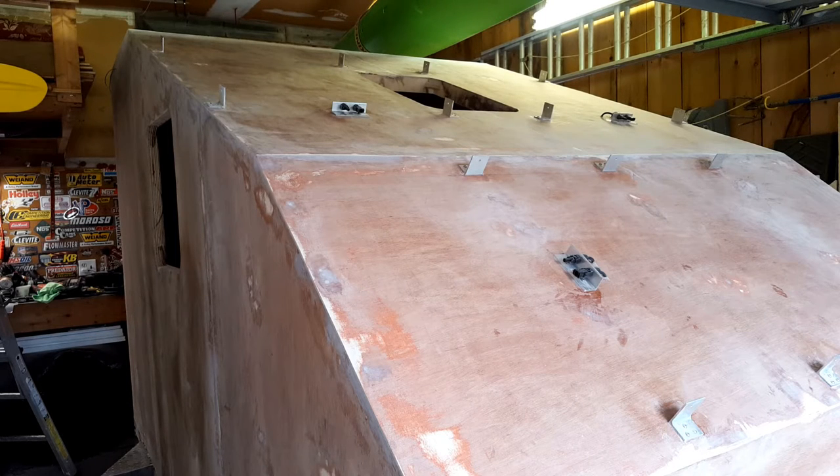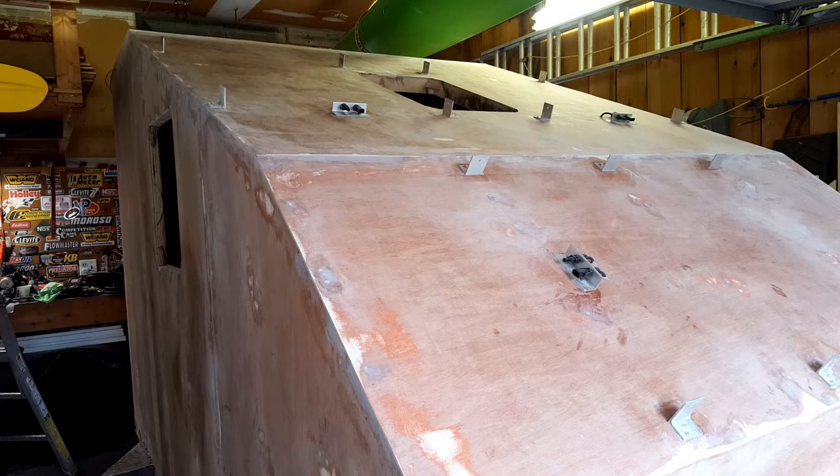All right, we're finished sanding. Fortunately, the battery died there, so you didn't see the whole thing, but anyways, it's all sanded now. At one point I started fighting with the vacuum, so I abandoned the whole dust collection system and just let the dust fly wherever. So now I'm going to wipe everything down with a microfiber cloth. Originally I was going to use a wet cloth and wipe everything down, but with my luck with plywood on this project, the whole thing is probably going to delaminate and fall apart. So I'm just going to go dry microfiber, and as the rag gets dirty, just grab a new one. So hopefully that's going to be okay so that the epoxy will adhere, but we'll see.